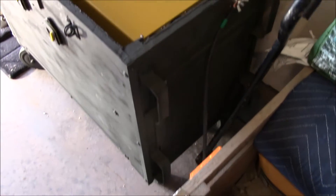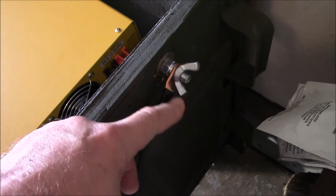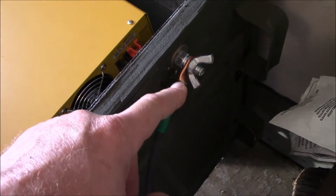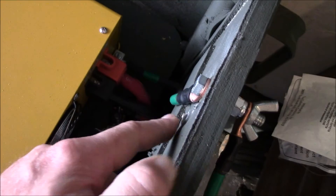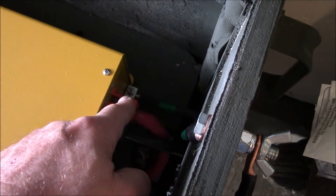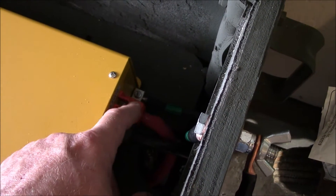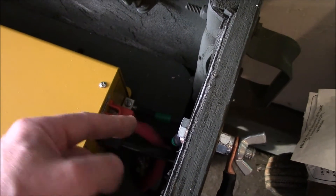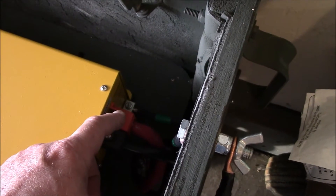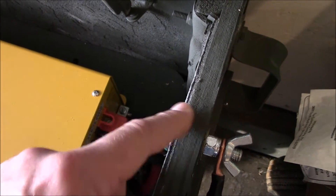That goes into the wing nut here with a bolt and a crimp. On the other side, another crimp through the bolt, and that goes into the inverter's grounding lug — that's number four Temco welding cable there also. I took a Fluke ohmmeter to test the resistance from there to the other end where the battery jumper cable end is — it was zero ohms resistance, so electrically through the whole system there is no resistance at all.